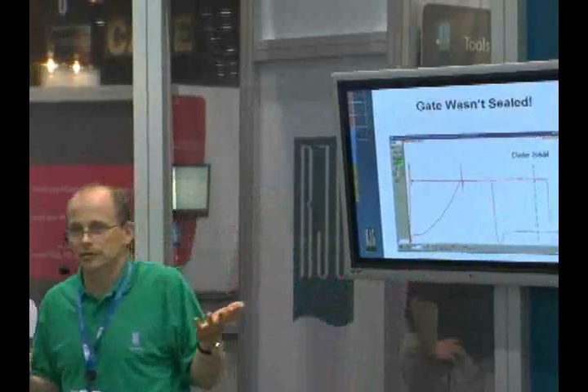When we went back and used a systematic approach — filled fast, increased the melt temperature, increased the hold pressure, and sealed the gate — we couldn't break the part. The customer had spent a couple weeks on this experiment, running parts and pulling testing samples, but within about an hour of following good, simple processes for setting up a process, we created a result that made sense and was much better than the DOE had told us we could achieve.